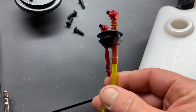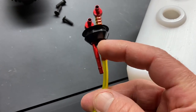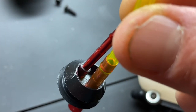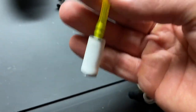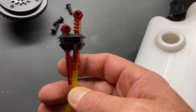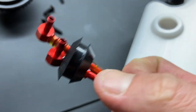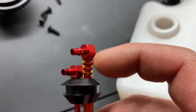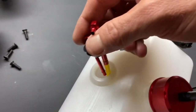I've eliminated the three-hole grommet and got a two-hole, and I used my cool little billet red high-flow fuel connectors. One will just go down in the tank like so, and I used a piece of fuel tubing on the end to squeeze the hole up. This line is just a short line with the filter because it's only going to go over and lay on the bottom at the lowest point of the tank. To get those on there I put a tiny little bit of grease around the nipple and pushed it right on — no problem. Leave this piece slid up to the top so you can get it down into the tank easy.